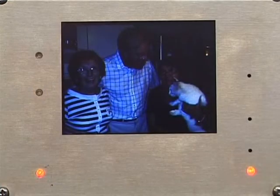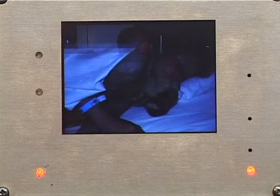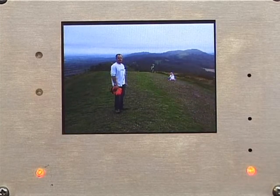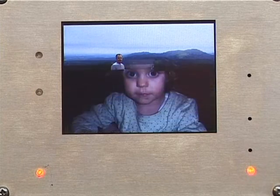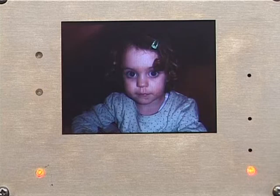Here we see a slide show operation. The SDIO controller is operating in DMA mode and has a clock running at 9 MHz. It was found that trying to operate at 18 MHz clock caused either TX underruns to occur or RX overruns to take place. This was in fact exacerbated by operating the TFT controller, which also uses the DMA.